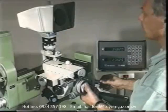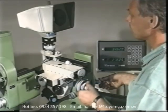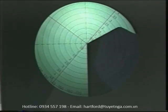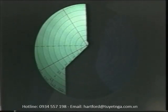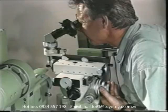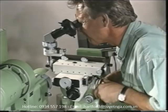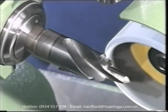You can use the reticule and adjustable crosshairs in the optical system to check radii and angles. The projector version is particularly suited to grinding profile tools to templates. The advantages of the optoelectronic measuring system are clear: as there is no longer any need to go back and forth between the tool grinding machine and the measuring station, grinding time is reduced, often by as much as 50%. You also achieve an extremely high repeat accuracy by avoiding mounting errors. The microscope version does not require backlight and allows unobstructed measurement of tools mounted on a support arm assembly, offering more freedom of movement.